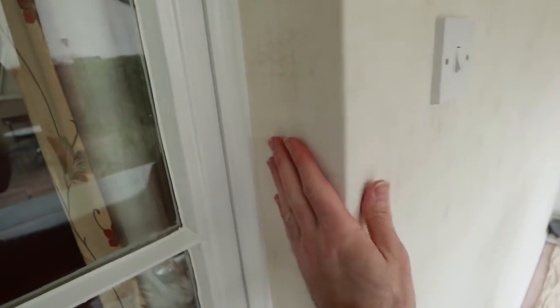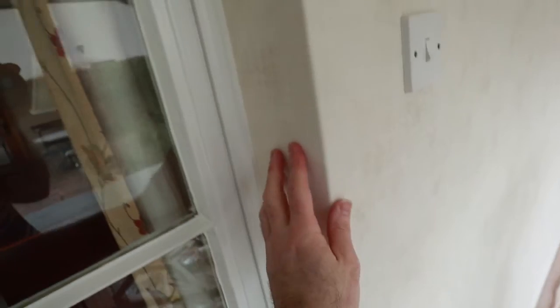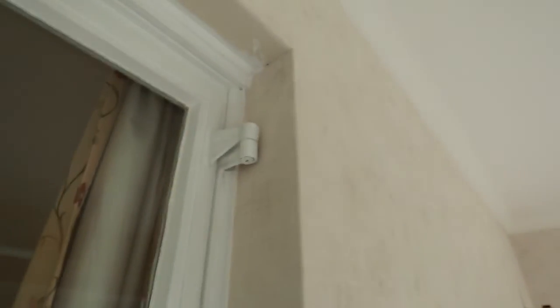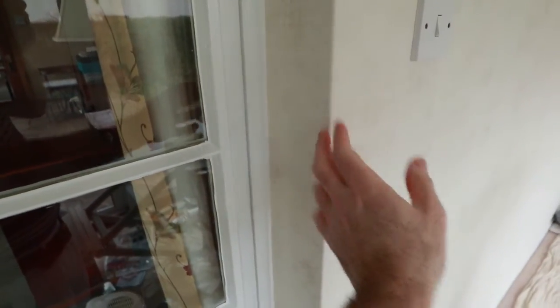Start with the middle, get it working, get a sponge on it, work it round the corner and go to the top, then from the middle back down to the bottom, and that you'll find a lot easier than trying to hang it from the top, wrapping it to the bottom. So top tip Tuesday, when you are wrapping round corners and externals, start with your middle and work up and then down, or middle, down, and then up.